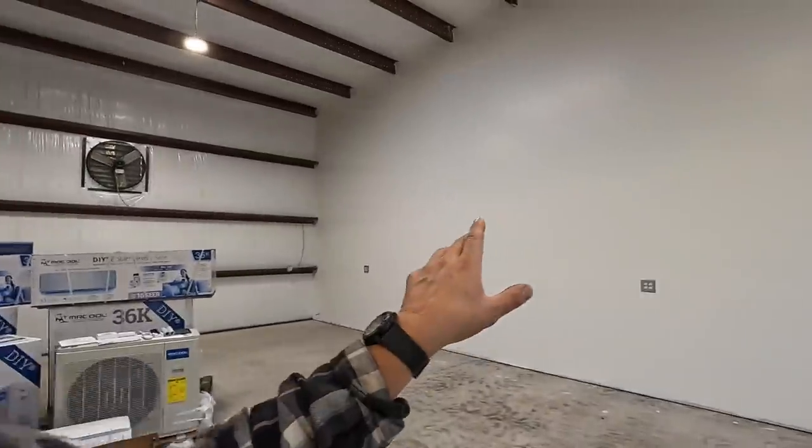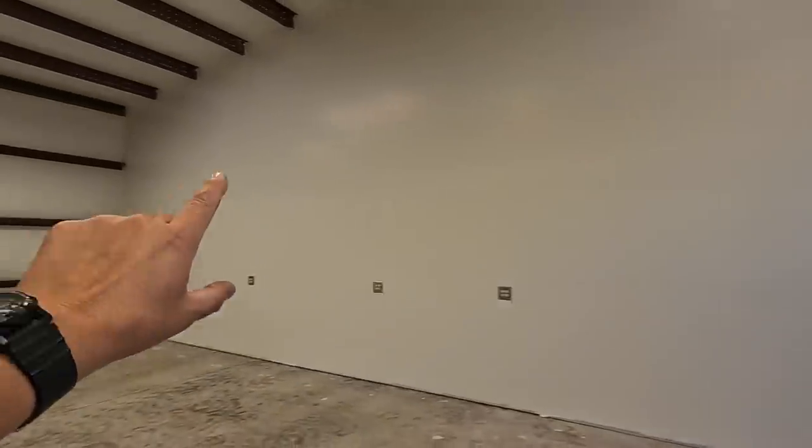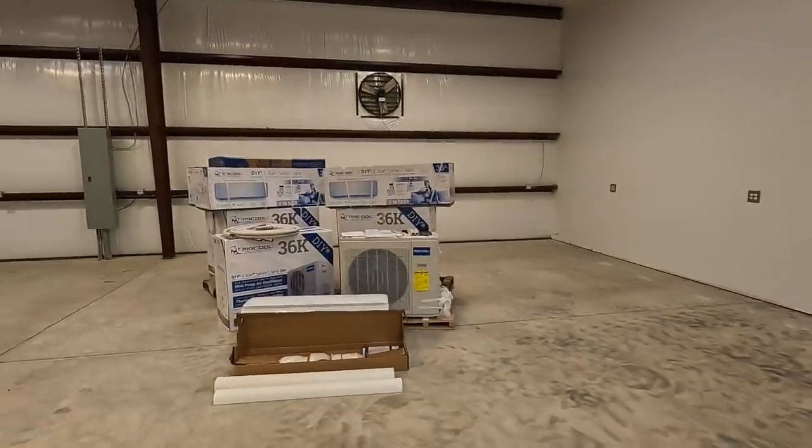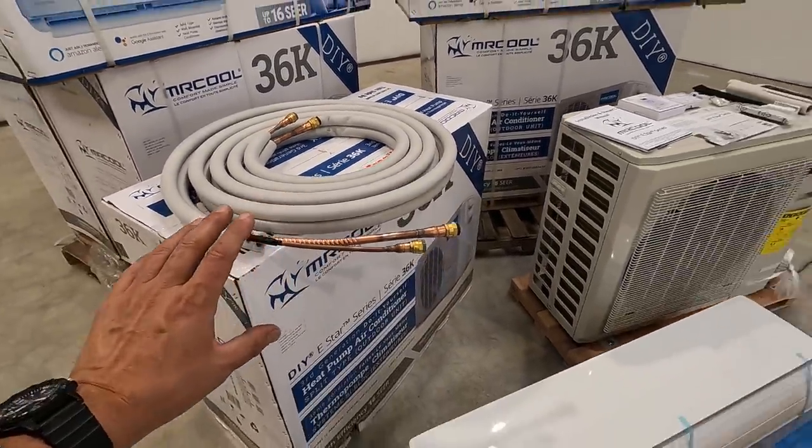It's always nice having a helpful hand even if you're doing this yourself without a technician — it's nice to have somebody there to help move things around, especially when you go to set the air handlers up on the wall. It helps to have two or three people there to hold things in place. I also want to mention that one of these systems is going to be modified out of the do-it-yourself category because the supplied line is not going to be quite long enough to reach from the air handler all the way down the wall and down to the condenser.